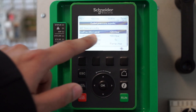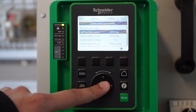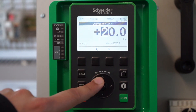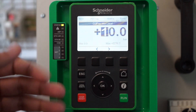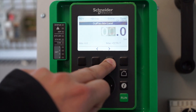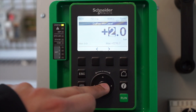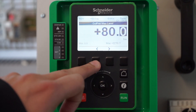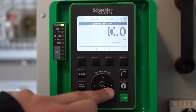You can see our levels are set to 20 bar and 80 bar, which is not in line with the range of the sensor. So we need to define the exact values at which we want the drive to trip for a high or low pressure level. We can define the low level as 2 bar and the high level as 8 bar.